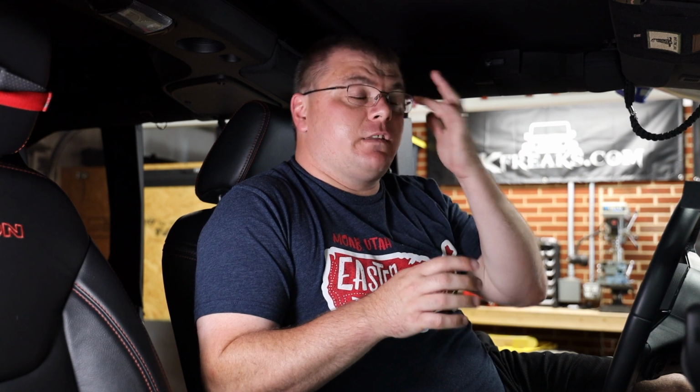Squelch sensitivity. This is one of their only radios that has this feature, which I think is really big because squelch is how far you're going to reach. So let's just say you're trying to reach someone that's really far, and let's say they have another MXT-400, you're at 30 miles, and you want to talk to each other, but you can't. You can barely hear them. So what you could do is break the squelch, and you're just going to hear the radio static, but you'll be able to hear the transmission through it very, very slightly. It's not going to be very clear and crisp, but if that's your only form of communications, you're out of cell phone coverage, it's the only way you can talk to somebody, it could be the difference between getting the radio call through.